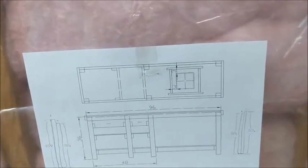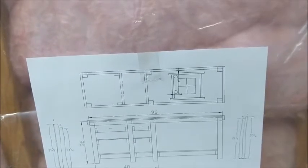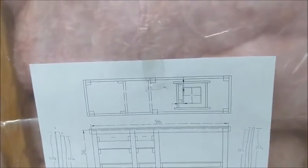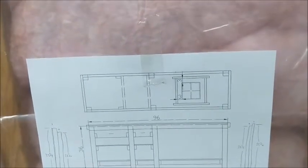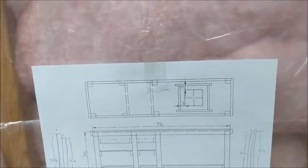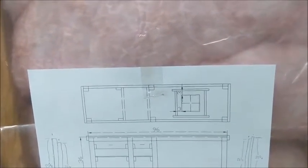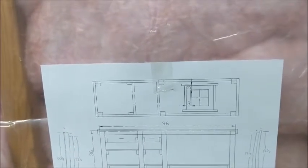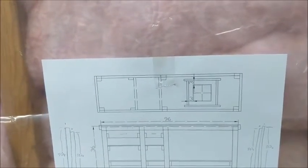So once I get the center at 0, from whatever I'm using, like the table saw or the jigsaw, I'm going to try to make it absolute 0, and then I can put one of those tapes inside the track so I can measure exactly how far to cut. Like a normal table saw, I can use the T-track to clamp it down, so when I'm cutting pieces of wood, I can clamp down the dimension so it's easier to cut.